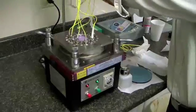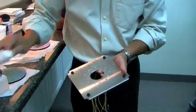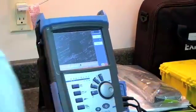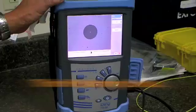For the first step, normally you do not add pressure. Once finished, clean the plate with an alcohol-soaked kimwipe. Repeat these steps with four different sheets. You can see here what the progression of the fiber and connector look like after each one of the four-step polishing processes.